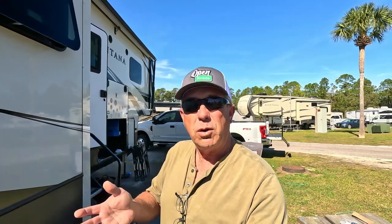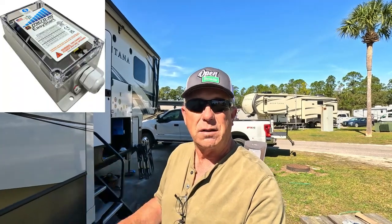Welcome back travelers. Today we're going to install a soft start. While we were at the super show here in Florida, we picked up an additional soft start for our rear air conditioner heater. We've already got one on the front. We really need those when we're running off of our solar system so that we don't have such a surge of power on the batteries when the air conditioner comes on. You can see up to about a 50 amp surge as that compressor kicks on, and after the soft start it's only about 12 amps. So we're going to go through the process of installing a micro air soft start on our Coleman Mach air conditioner heat pump on the top of our rig.